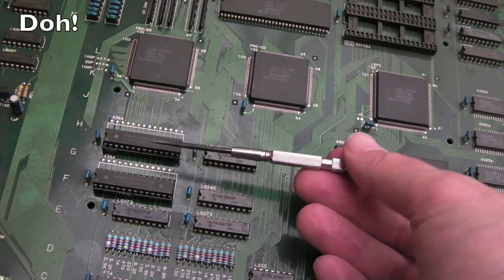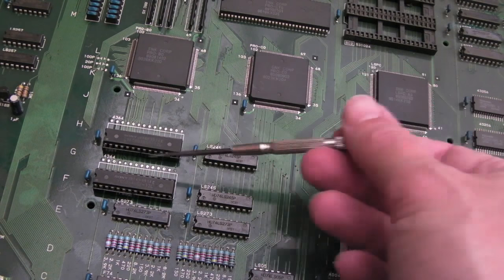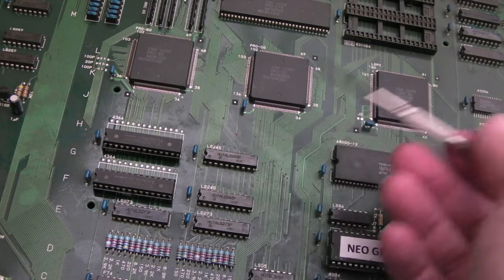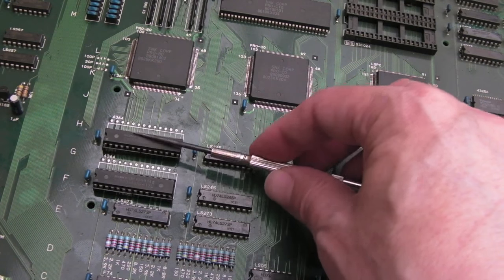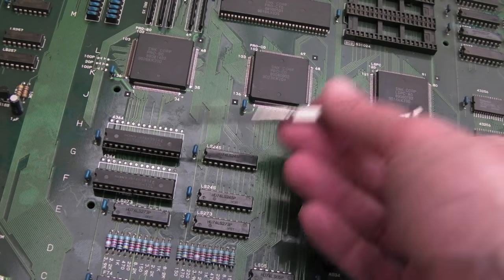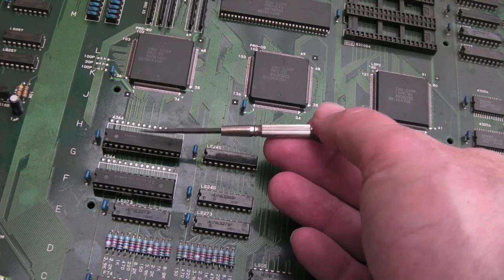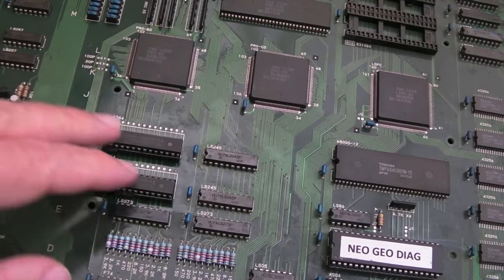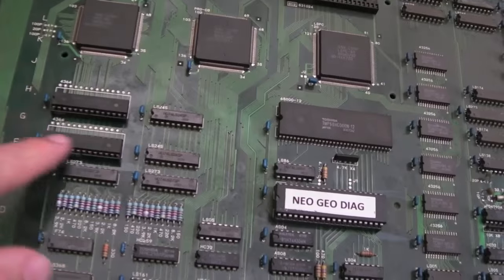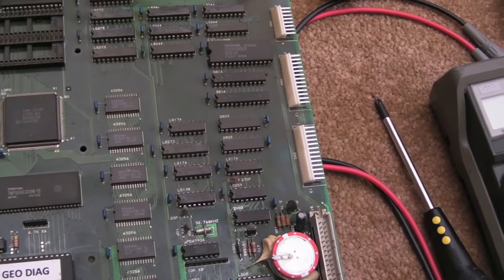What is interesting - these are not the right chips. These are the palette RAM chips. I know that because if you remove one it fails on the palette RAM check, and the data word that's come back is exactly the same even after swapping these chips around. It was only after removing one of them and realising we're getting a palette error - you can see the text changes colour like it's trying to do a palette test. This is the palette RAM. So this is a bit different from some of the other MVS boards where the long thin chips are used for the fast VRAM.